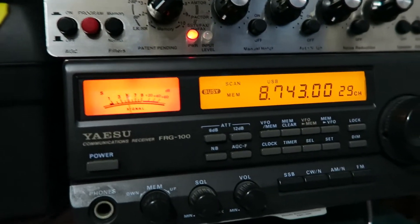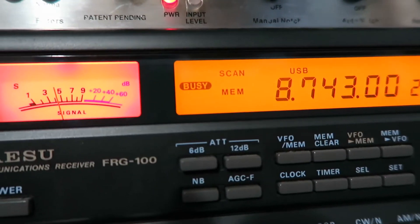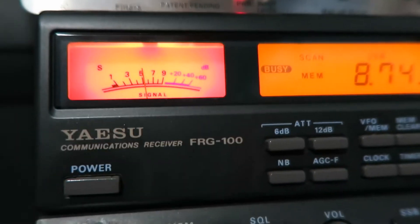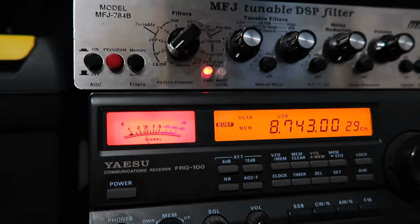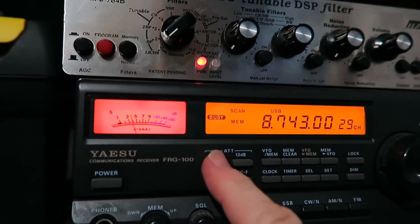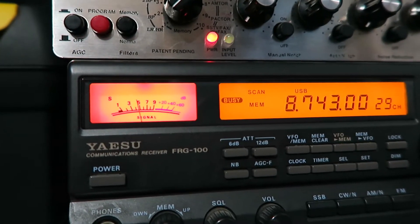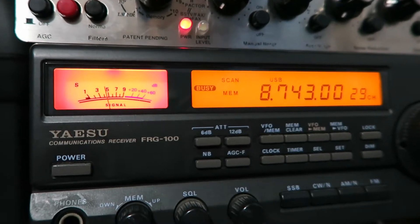This is 1831 on the 11th of September 2017, and we're continuing with experiments of the antenna system to avoid interference. This is the MiniWhip mounted at 550cm high, which is kind of a recommended sweet spot. What we're listening to now — and the little tune you heard — is from Bangkok Metro, so it's pretty good to receive it from that distance.